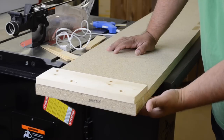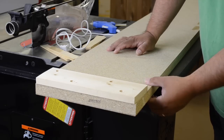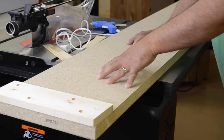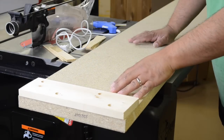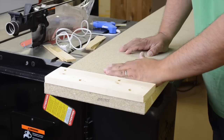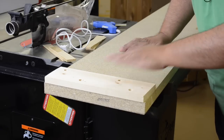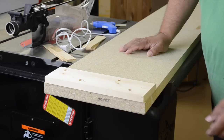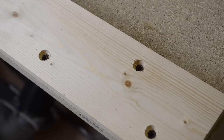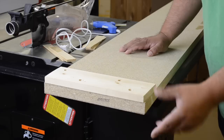So this is all there is to the thickness planer sled. The base is a one and one eighth inch press board — industrial shelving — available at the home center in various lengths. There's also a piece of scrap that acts as a toe kick so I can rest the material against it and keep it from sliding through. I screwed it with countersunk screws in case this first layer gets nicked by the thickness planer.